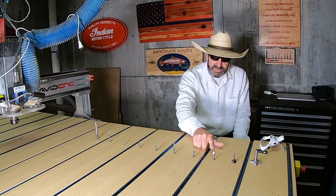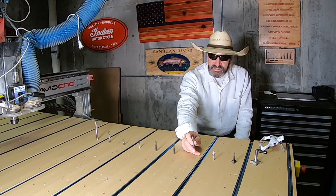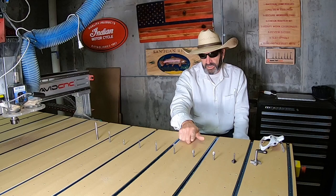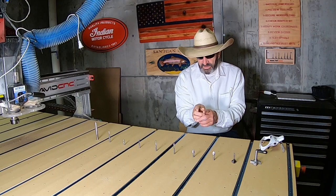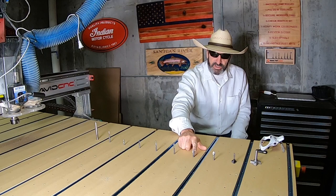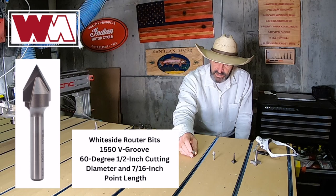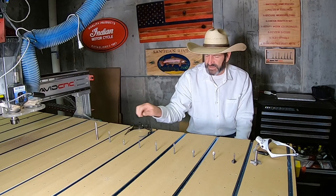A few times I've used this 60-degree — you can see it has a sharper point. The only thing about the 60-degree is it can do more intricate little things, but it can also go a lot deeper. So if you were to try to do a half-inch wide letter, you might be poking through some three-quarter-inch material, so you've got to be careful. This 60-degree bit is a 1550 by Whiteside, but I mostly use the 1502.